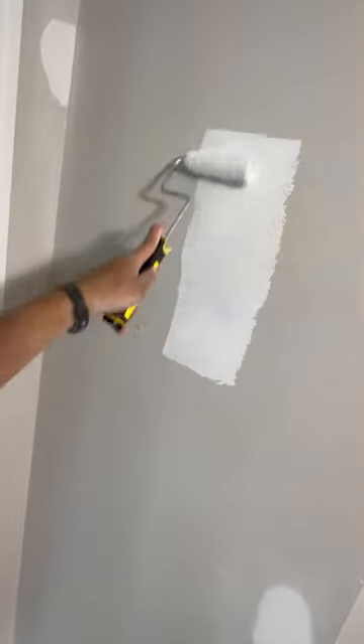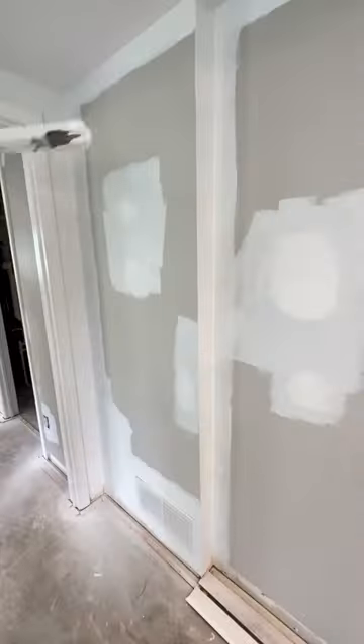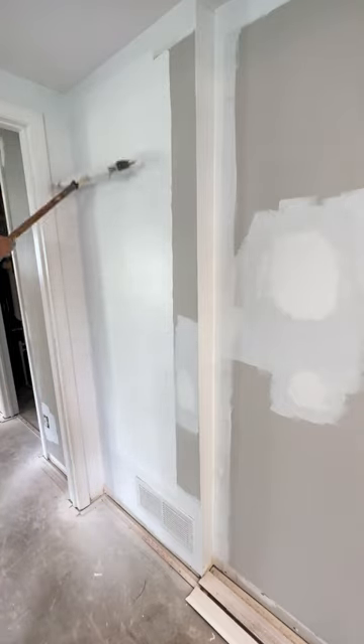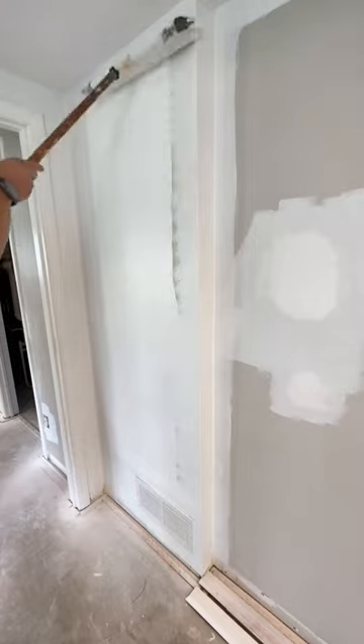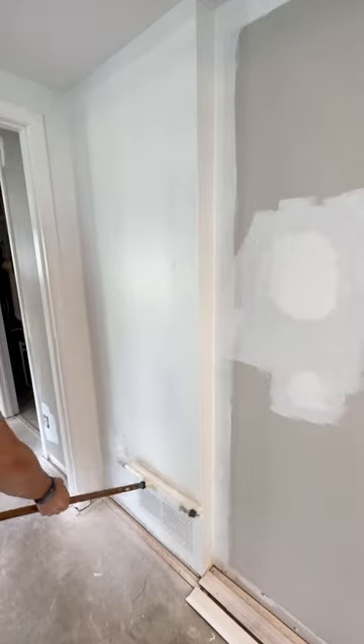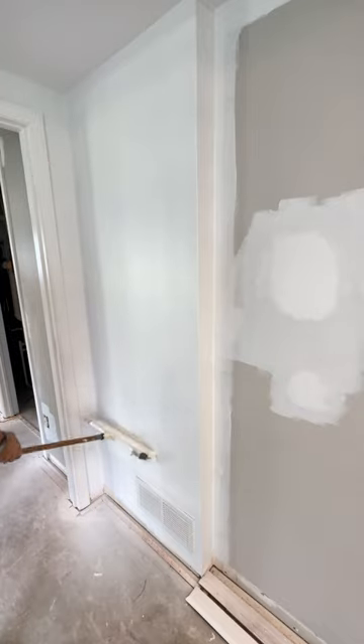That quick little prime is going to give that perfectly smooth surface a little bit of texture from the roller, and then we can hit it with the big roller after it dries. That step is so often missed, and if you do miss it it's going to show every single time — it does not blend properly. We'll finish off the room with a second coat with the big roller, and once both of those are dry you'll never know this room had 97 holes in it.